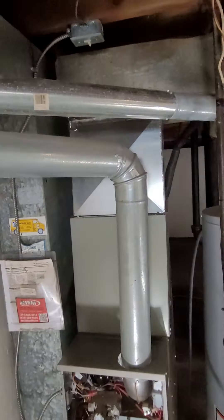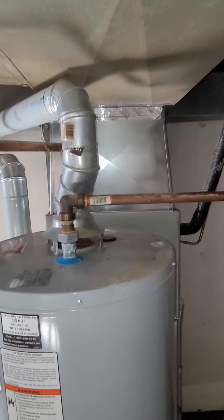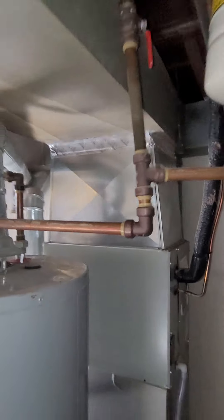The plenum is coming up straight and it goes right into this supply. It does taper to fit this — this is a 19-inch wide supply trunk.